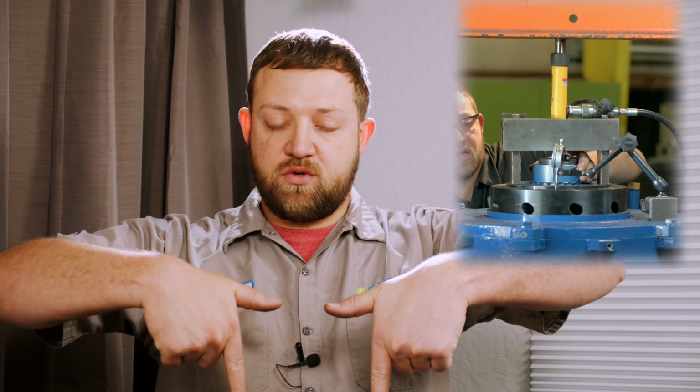And then when I get my rig all set up, that C channel that you see between the spreader bar and the carrier, I like to compress the springs and then make sure that you get a full release. Because sometimes, depending on if you did machine work on the shaft right there, if it was tapered, you would know your carrier would get stuck. Those are some of the other things I noticed on setting Endplay on these type of things.